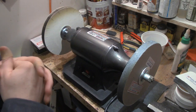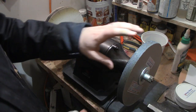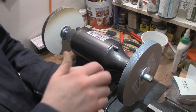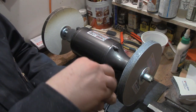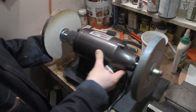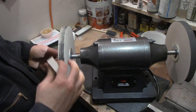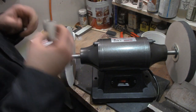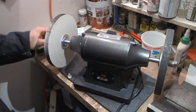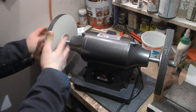This is a really neat way to sharpen a knife. It takes a little bit of effort to figure out the whole process, but once you get it started I was sharpening several knives and was really happy with how it worked. This is the grit side of the wheel and it comes pre-charged with grit already on there. They give you a little container to reapply the grit to that wheel. There's also some wax they recommend to apply to this side — you use white rouge on this slotted wheel, and it really helps with the final polishing and buffing of the knife edge.